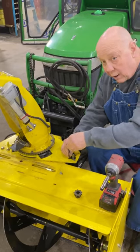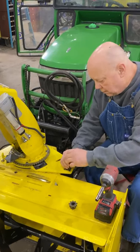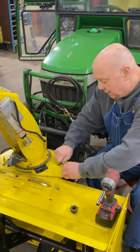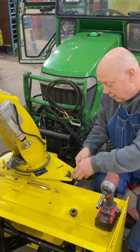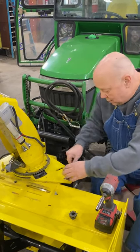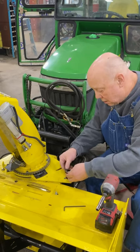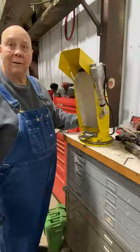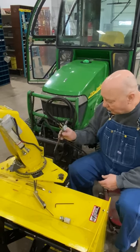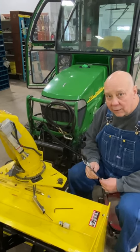Some of these parts may vary — some are going to be metric, some are going to be SAE standard. So you will need both metric and standard tools to put this kit on. I use a dial indicator or caliper to adjust the sprockets. You can use whatever — it's not that critical, as long as all the sprockets are in the same plane and relatively close.